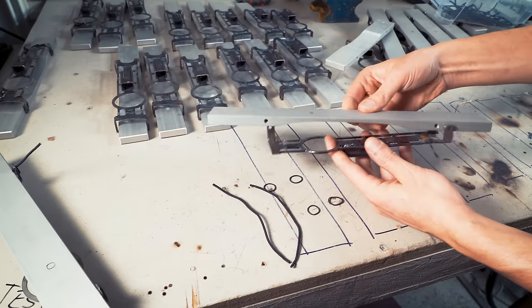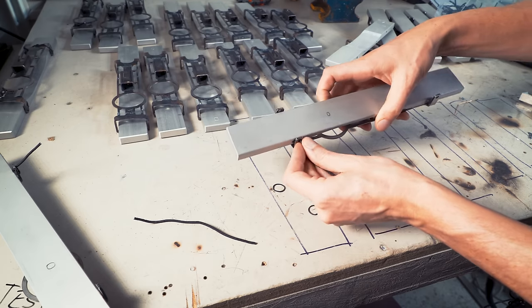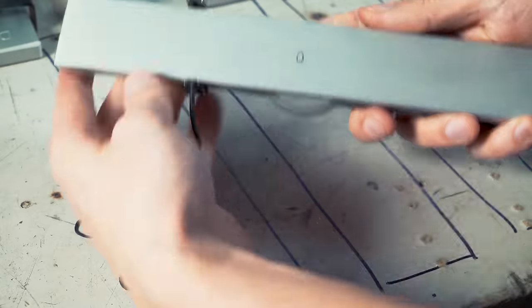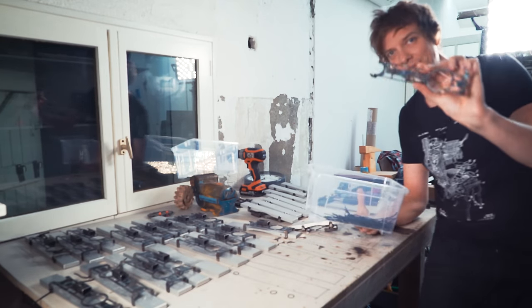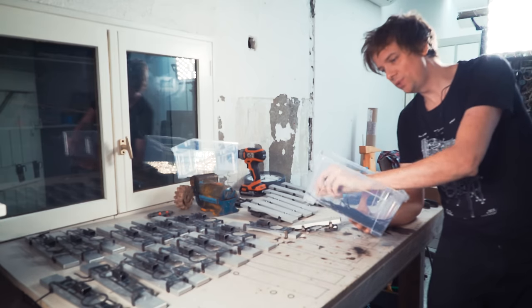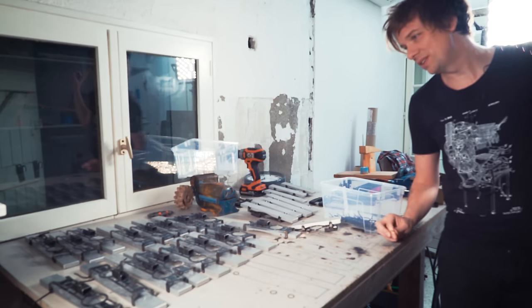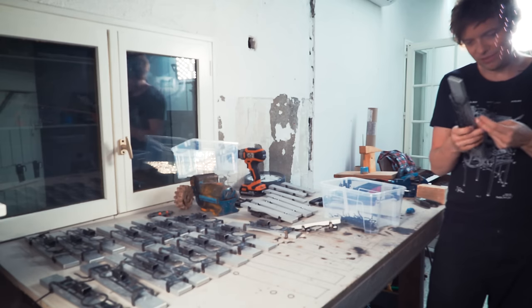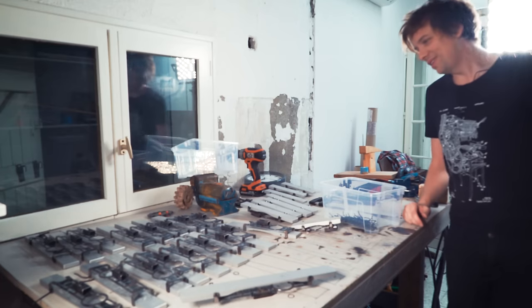To attach the bar to its holder, I have two pieces of elastic and four rubber bands. I put the elastic through here and through the vibraphone bar and out on the other side, then I put this rubber band over so it prevents metal-on-metal contact, and tie it on the back side. My plan was to tie all these bars to all the new welded holders. But in the livestream, someone pointed out I should use silicone-based rubber bands because they don't disintegrate. I just talked to James and Richard from the engineering team, so I'm ordering Viton O-rings — great for the world tour. I had enough of disintegrating rubber bands on the original Marble Machine.